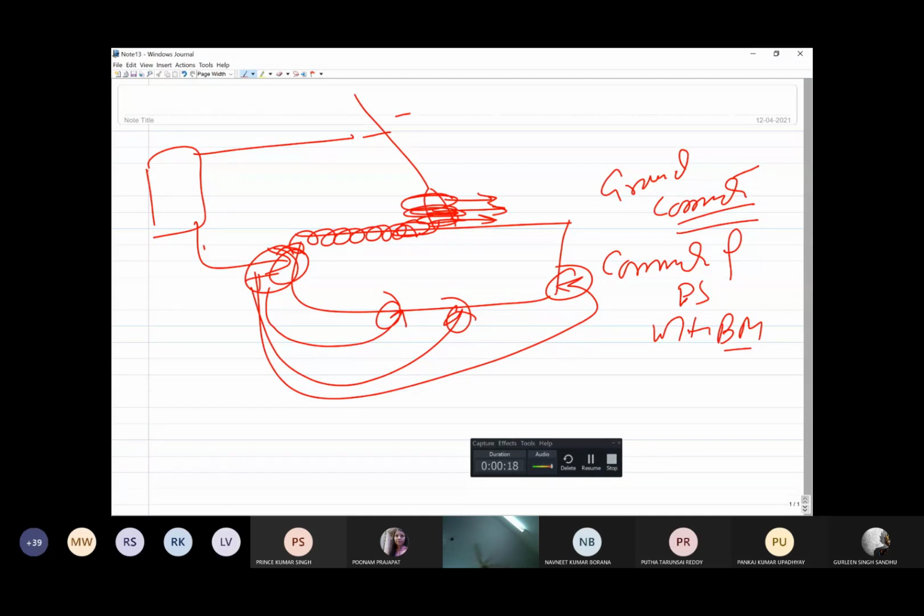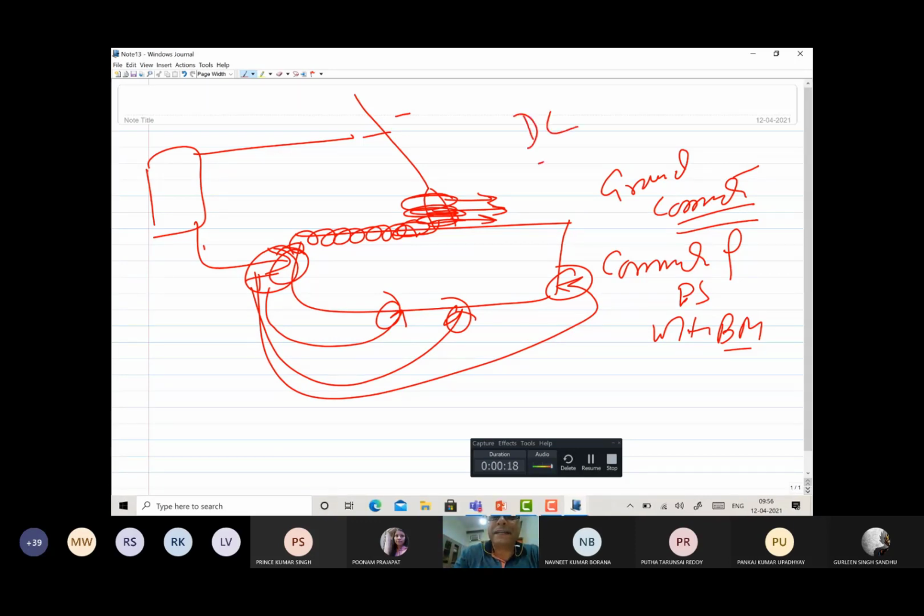So this is about the cause of the arc blow in SMAW. This is mainly observed in case of DC welding. Why? Because the flow of current is always the same, the direction remains the same, the magnitude remains the same. That is why the fields keep on interacting.